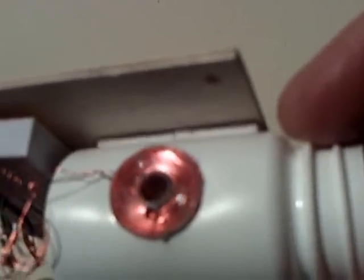There are two coils inside of it, and both of them are air core coils — 30-gauge wire wrapped up on a plastic sewing machine bobbin. There are holes cut in the side of the plastic bottle and you stick the coil in there. If you cut the hole just right, it just stays in there; if you don't, you have to put a piece of tape on it.